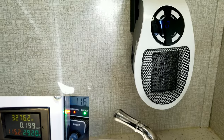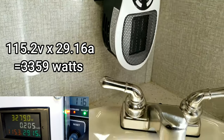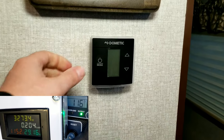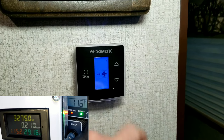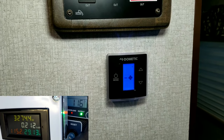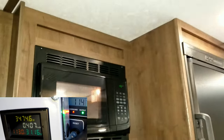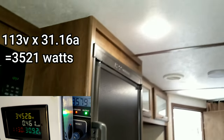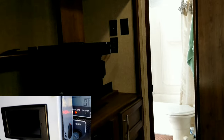Adding a small heater brings in about three more amps, pushing close to 30 amps total. Turning on the fan on high adds about another three amps. Now the overload light is fully on, the generator is running at top speed, and normally you'd expect it to shut off in about 10 to 15 seconds. There's a voltage drop to under 114 volts — you want to stay at 114 and above. And it shuts off. It did a really great job holding on as long as it did.